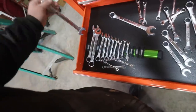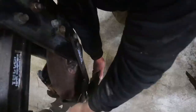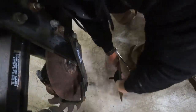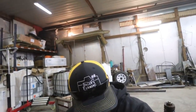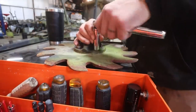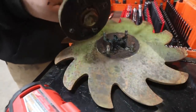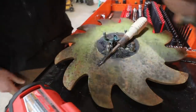You know it's going to be a good day when you guess the right wrench on the first try. Looking at this row cleaner — I don't think the bearing is actually out. I think the bolt that holds it on was just loose. I'll clean it up a little bit and get it off to find out. I'm about 99% sure this bearing is fine — doesn't look to be out, it spins. It's been kind of stiff but I think some new grease will help that a lot.